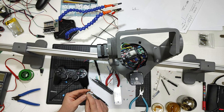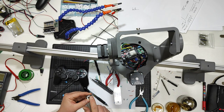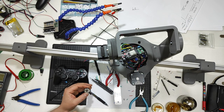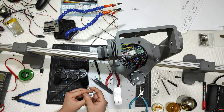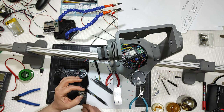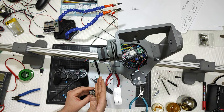But it's very hard. Look at how they have moved now. It's very rare that a joystick, a stick like that, will remain precisely at zero position forever. Once you start using the gamepad, you start to go a little more towards the X, a little more towards the Y, and this will no longer have a zero point where you don't have electricity going, not in the X, not in the Y axis.